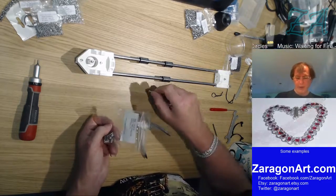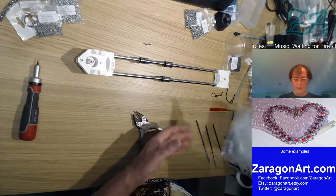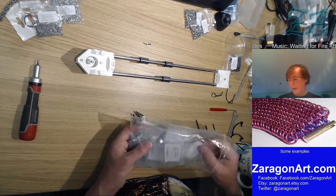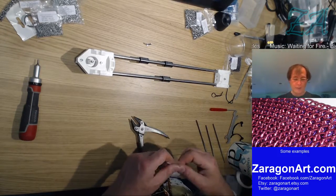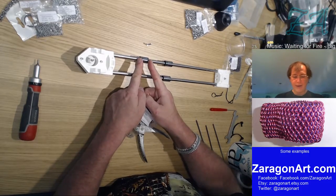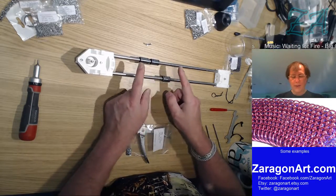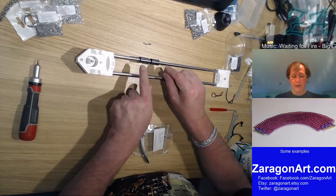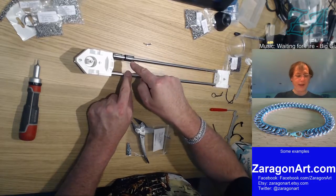I'm also kind of interested in printing multicolour objects, using multicolour filaments. And this printer will do it in that I actually have three extruders for it, so I can print in three colours. The only problem with these sorts of printers, with three heads and three extruders, is that you get one extruder, let's say here, your next extruder sits next to it like this, and your third one sits next to it. Now they're wider than this, but what that means is that when you fit three extruders, one of the first things that happens is you reduce your build volume, because now this extruder, if it moves all the way to the left, this is as close as it can get to the end.